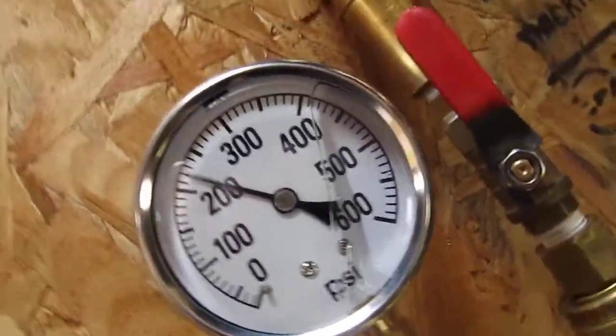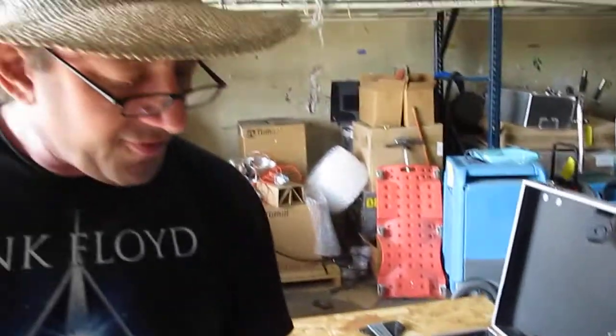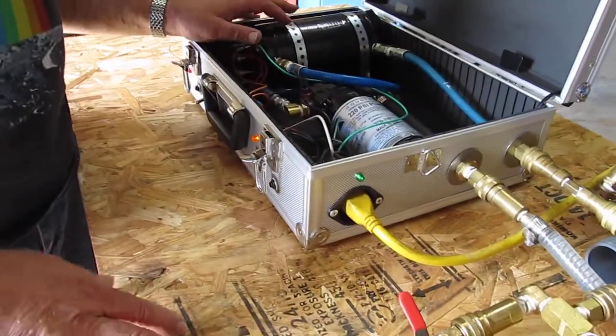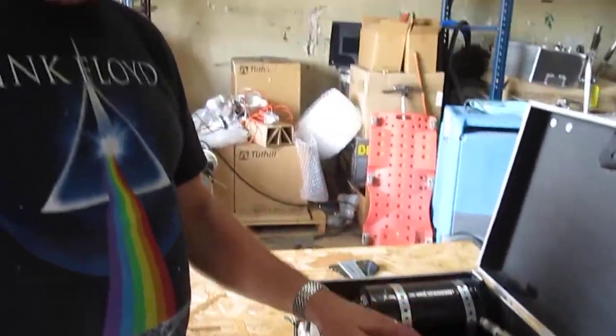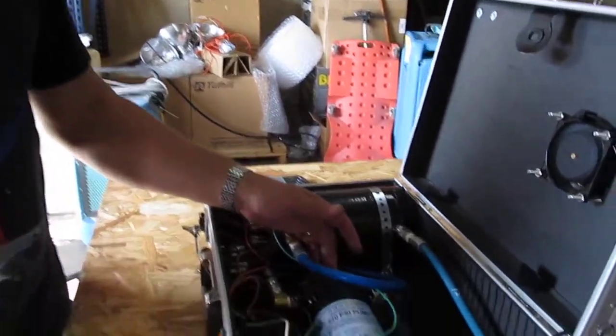We can put different tips on it, and as you go to larger tips, that lowers some. If you use it in a building where the inbound pressure is higher than 50 psi, then your outbound pressure for the same-size tip is going to be higher. The pressure switch has been pre-adjusted to 250 psi — we do not want you changing that or going any higher. If the pump is cycling on and off through a number-two tip, you'll just have to go to a larger tip, because this is as high as the manufacturer has authorized the pressure switch to be set.